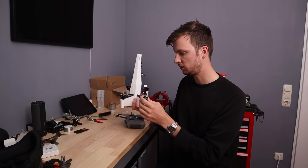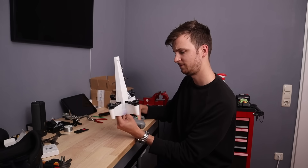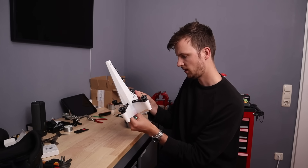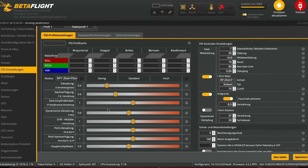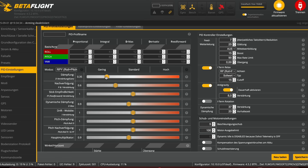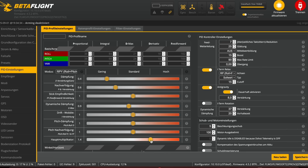During the first startup I got ultra bad vibrations — I didn't know why this was happening, but it did not sound good. This vibration problem has a very specific cause: the frame is not stiff enough. The solution is called PID controls. With these controls I can adjust how fast the flight controller reacts to movements of the frame, and by dampening them more, the vibrations should get better in theory.